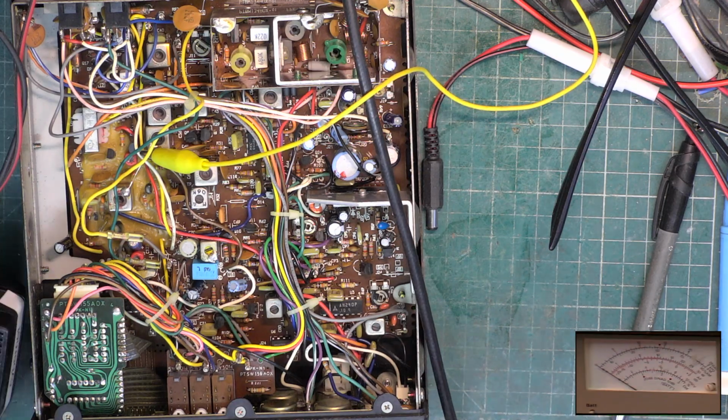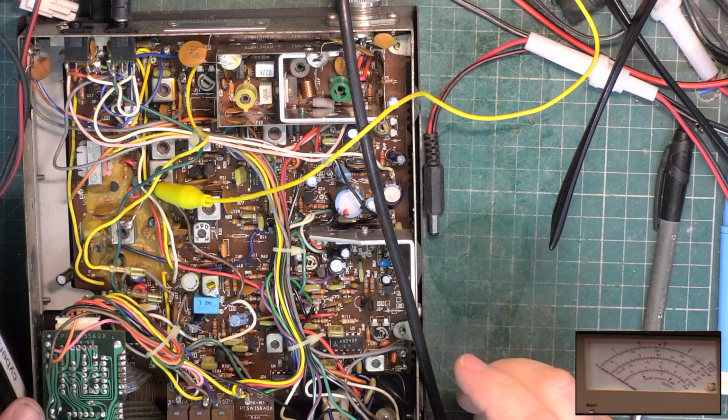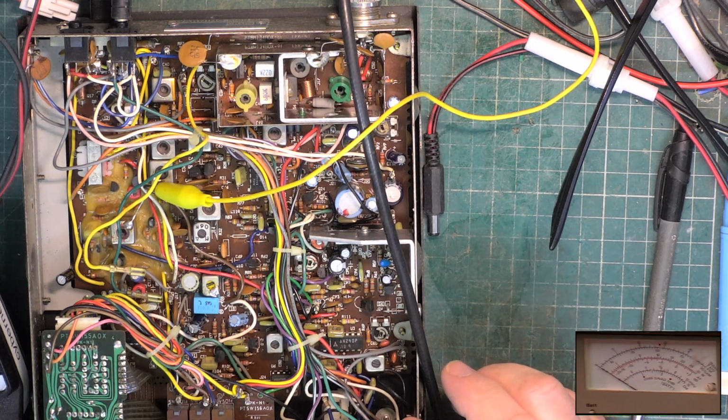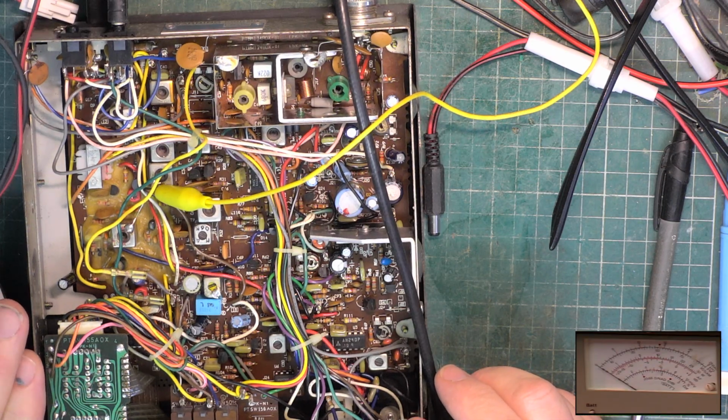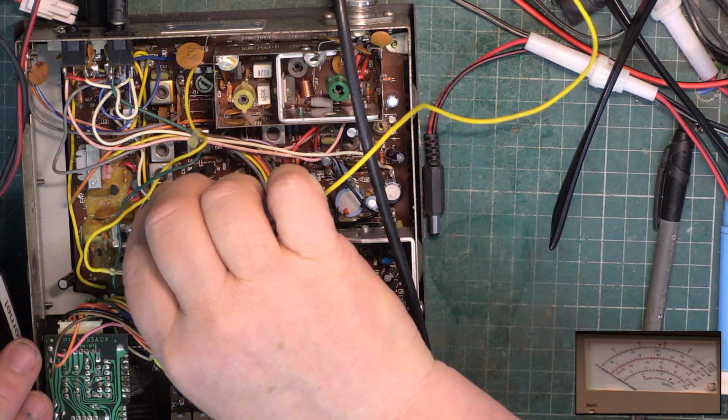Nothing worse than channels not being there with an incorrectly set VCO. You find that in temperature extremes, radios don't work above channel 37 or don't work below channel 2 or something. You get that kind of scenario if the VCO isn't attended to from time to time.